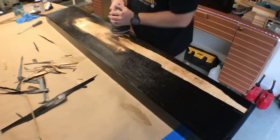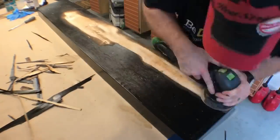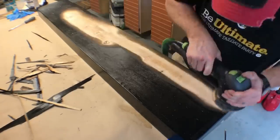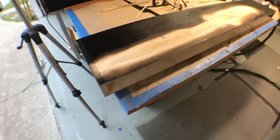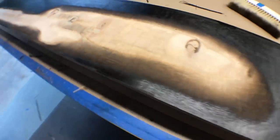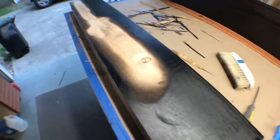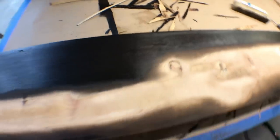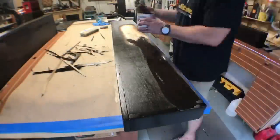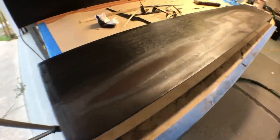I went ahead and did it. What I'm doing here is sanding down where the pieces are delaminated right to where the adhesion still holds to the boards — creating a kind of rough texture. My wife says to go ahead and use some dark stain on it. As I'm looking at this, I start to see the light at the end of the tunnel. I apply the stain and think: this isn't too bad.